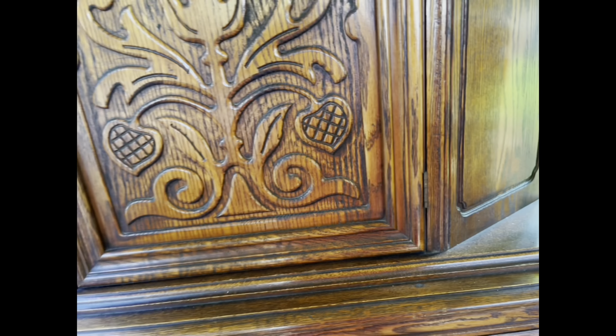The clear wax is on and I pulled back the plastic on the top of my buffet. Now I'm ready to go ahead and add my stain to the top. Before I do that, I want to take a damp cloth and wipe off any dust and debris, and make sure that the pores and grains are open — because I'm not going to condition, I'm just going to go right over the top with my stain. The stain I've chosen is American Walnut — it's very thin — and I'll be using a lint-free cloth to apply my stain while wearing rubber gloves.